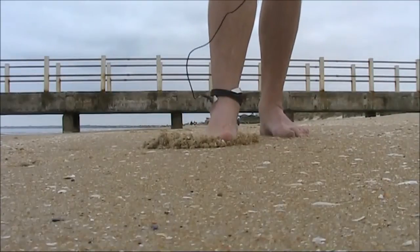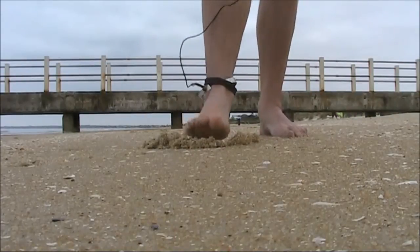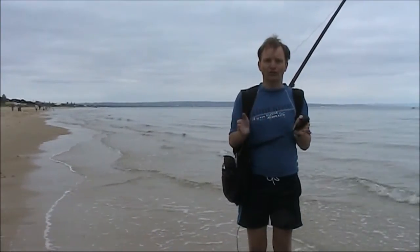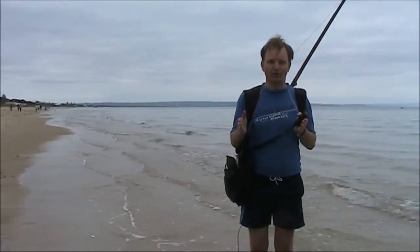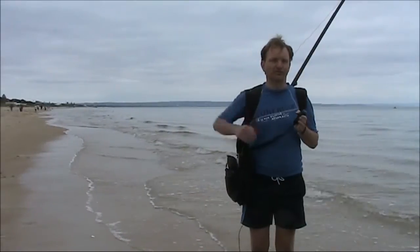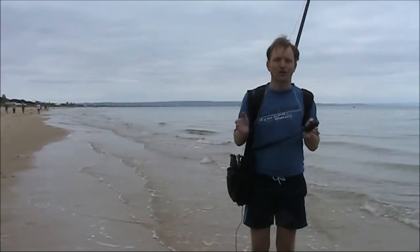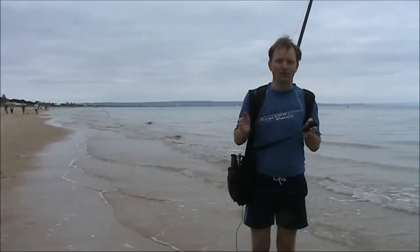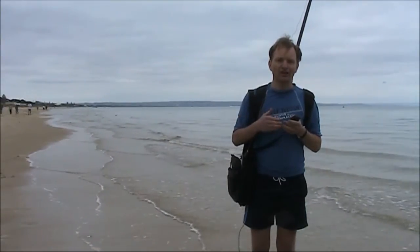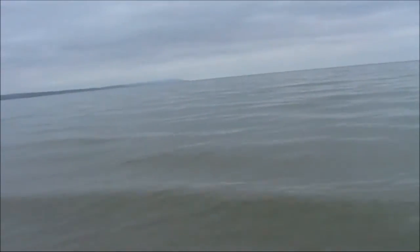I've got about 40 metres on it, and it's been on 80 metres. All the stations worked were within 100 or 150 kilometres. It's not spectacularly successful, but I think it's definitely better than the magnetic loop. And for some reason, walking in water seemed to have less difference to the signal than on 40 or 30 metres. The antenna's bandwidth is suspiciously wide, so there's no doubt that it could be made more efficient, probably with a better and thicker coil.